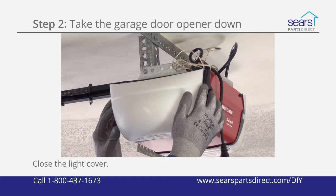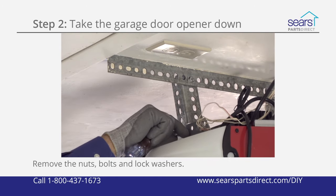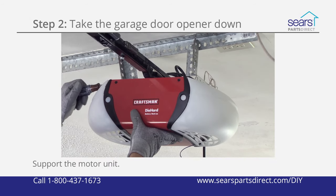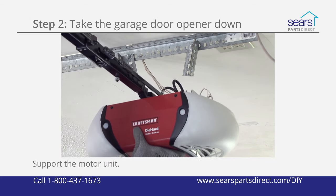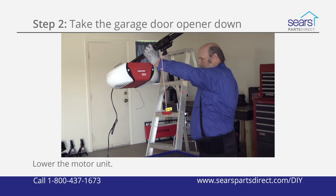Close the light cover. Remove the nuts, bolts, and lock washers that secure the motor unit to the ceiling bracket. Support the motor unit with one hand as you remove the last bolt from the ceiling bracket. Carefully lower the motor unit and rest it on your work table.